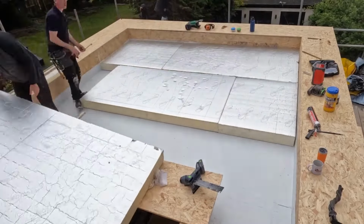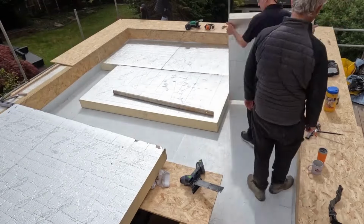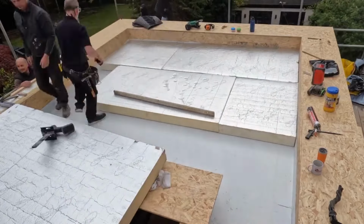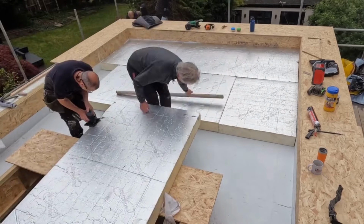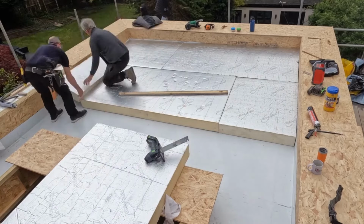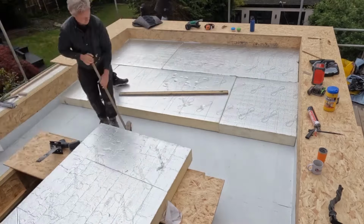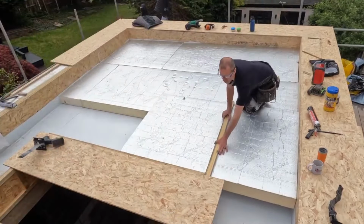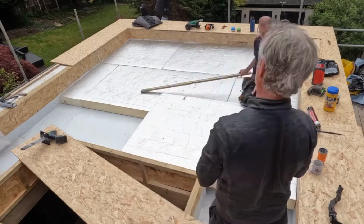And this is quite an easy, satisfying process. You just lay it down on top of your vapour barrier. And away you go. Any gaps, again, foam if you need to, but we tape all the joints as well, trying to keep it as airtight as possible. For those who are interested, that tool there that Richard's using is his Festool insulation cutter. It's an expensive piece of kit, and that is its sole job, just to cut insulation, but it really does give a perfect cut every single time, nice and square, makes the process incredibly easy.